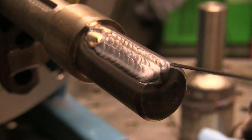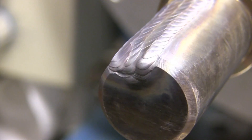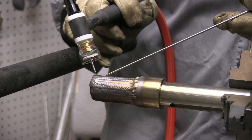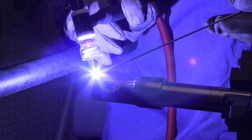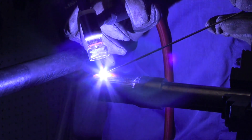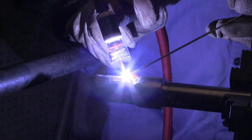There are some little low areas right here that will need to be touched up. I won't show the actual welding there because there's not much to it — I just touch those areas up, anything that looks low I put a little weld on. As is often the case when you fill up a keyway, you have to go all the way around the shaft to compensate for distortion. There's often a little wear where the keyway is, so in this case I just thought it would make for a more interesting video to build up the entire shaft.